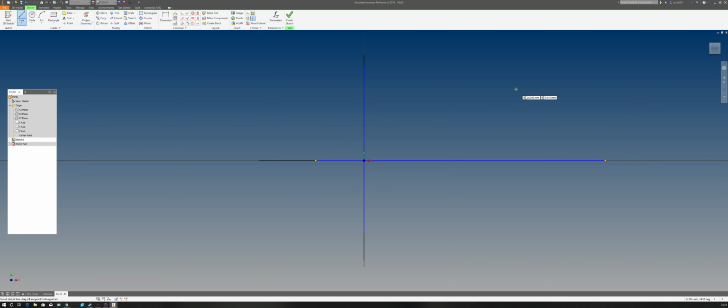Now I need to have a look at the book that I have because it gives me certain dimensions. So we have a two inch flange. So that's 152.4. So what we do, we draw a line to there, and this is what I mean by the dimension. You dimension it, and now from there to there, and we change that to 152.4. As you can see, it's moved off the page because obviously this is full size. So we extend that line up to there.